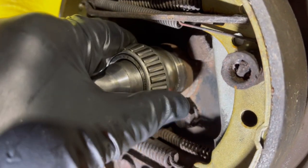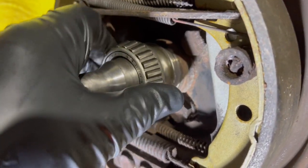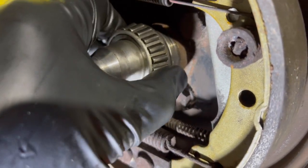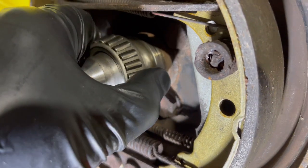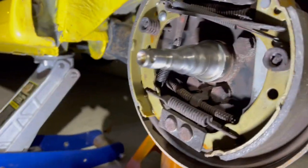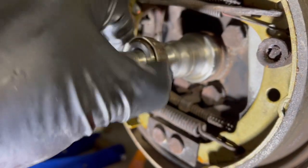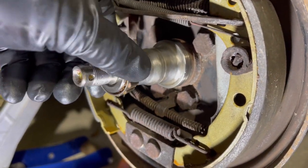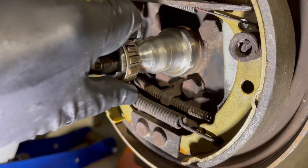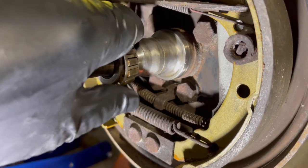The bearing needs to fit over the axle without catching — you need to be able to slide it on and off. It can't be so loose that it's falling off, but it needs to slide on easily. There's a little bit of a lip right here that's still catching it, so I'm going to work it a little more. I also found that the one on the end was the same way — it was dragging too. This is a lot better than it was, but I'm still going to work these a little bit more. The bearing is still dragging a little bit.